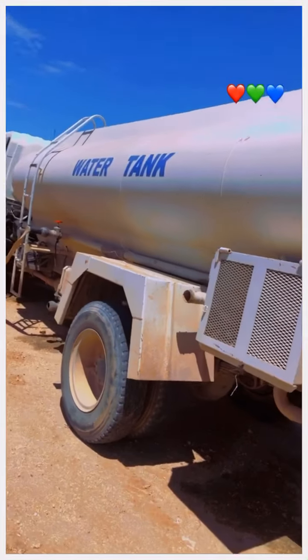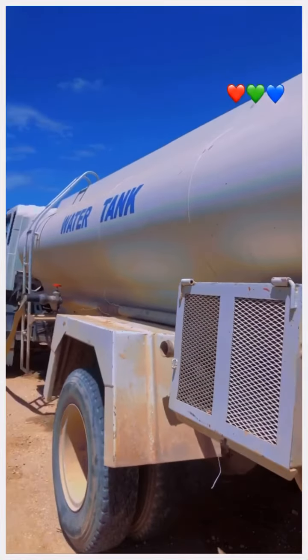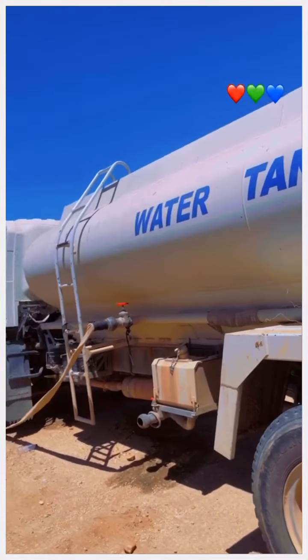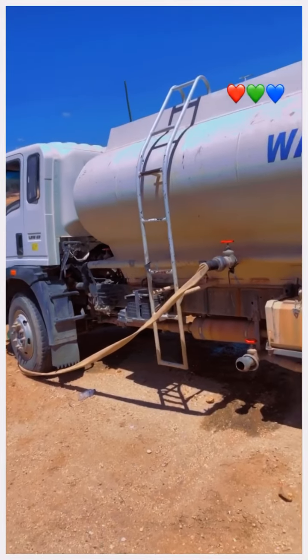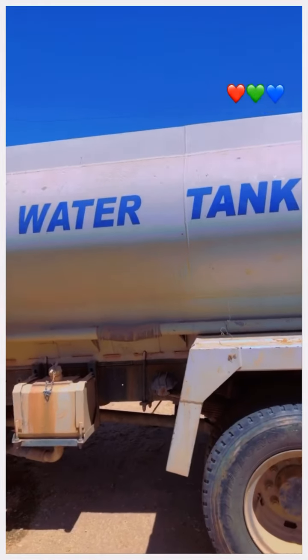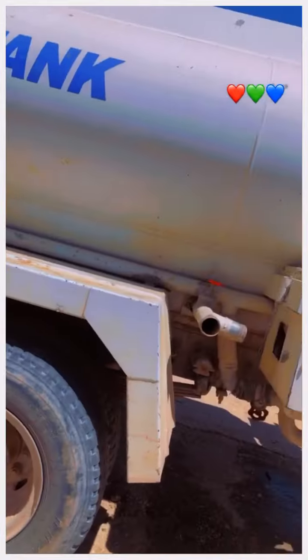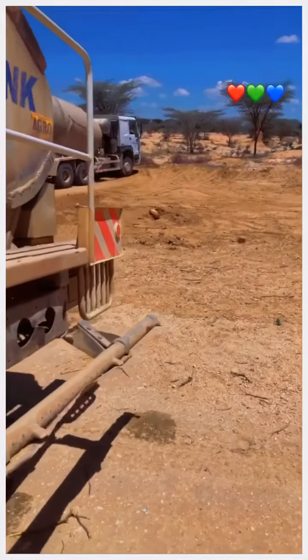When it's hot, like here, we experience hot weather. We have to wet the surface before concreting, and that is why we have a water tank on site — to keep wetting, for example, the steel reinforcement. Just flush water on it. Make sure that the concrete temperature is maintained as minimum as possible. That is also another factor.